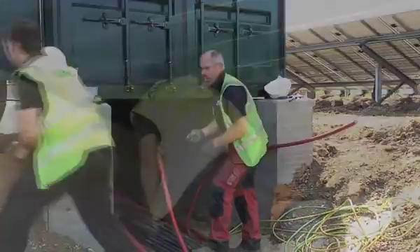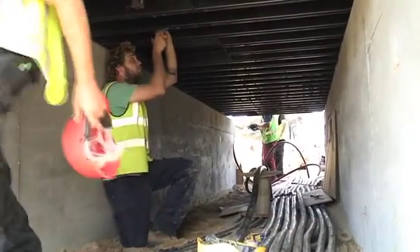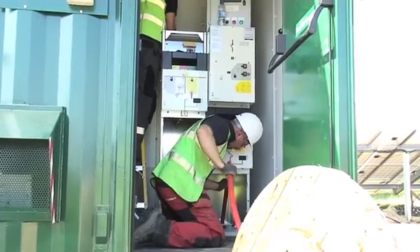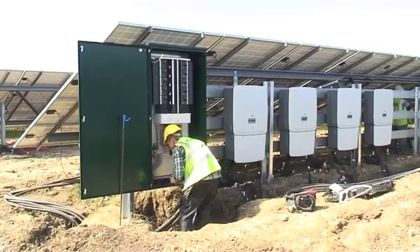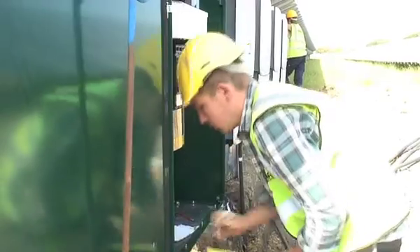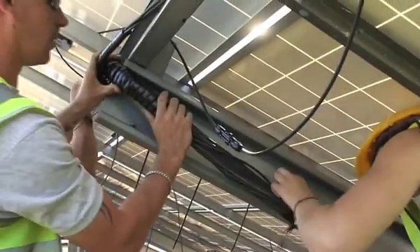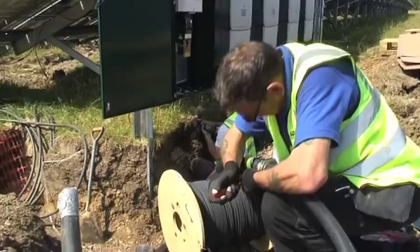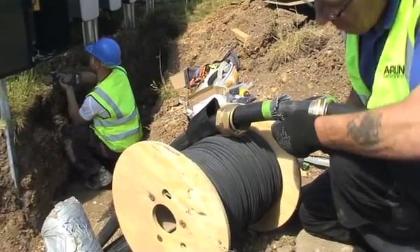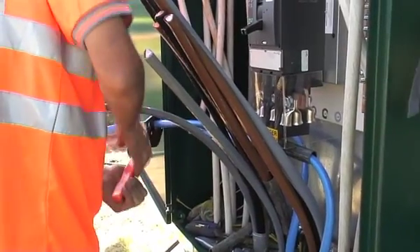This is probably one of the coolest places on site because the weather had turned extremely warm. We were in the last few days before the go-live deadline of June 27th. Here you can see the Burnell team feeding through the 11kV cables into the RMU — ring main units. We suddenly had lots of electricians on site doing the string testing, the DC cabling, and the high voltage cabling going in — it was a hive of activity, about four days to go. But there was never any sense of pressure or panic; they just worked so calmly and methodically, with a clear plan of how they were going to approach this.